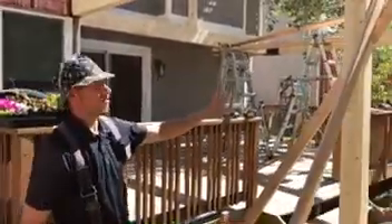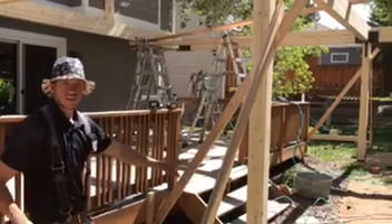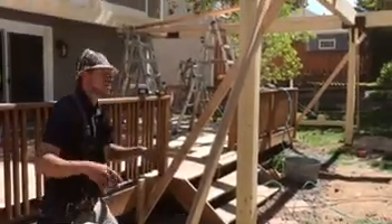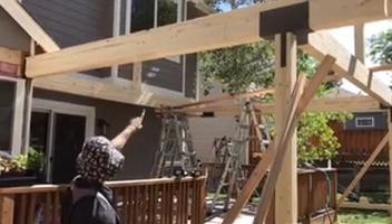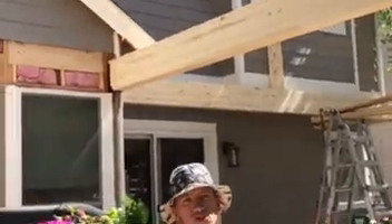This is our frame for our roof and this is typical of what we do for our covers. It's a little different than a house roof, but the basic parts here are the footer — in Colorado that's 36 inches deep concrete with a 12-inch caisson. Then we've got our post; we use Alaskan cedar glue-lams. We've got our beams running back into the house, and those beams are supported on studs within the house, so sometimes we'll call those posts too.